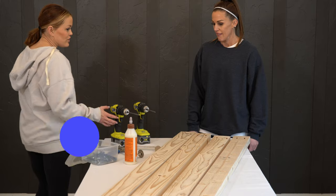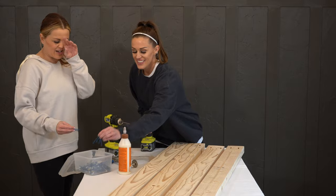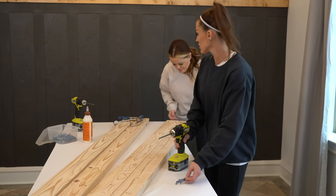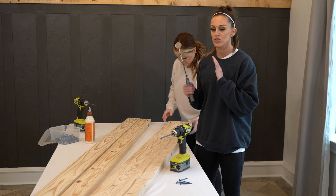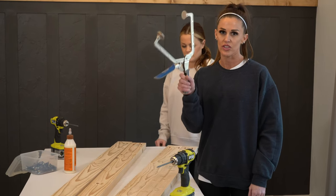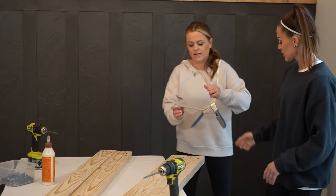We are adding 2 and a half inch pocket holes down. We'll use a face clamp for this part too. We get lots of questions asking how do you get your tabletop planks so smooth — do you use a joiner, do you use a planer? We don't use any of that. We use these $39 face clamps. They work amazing, and I can add a link.